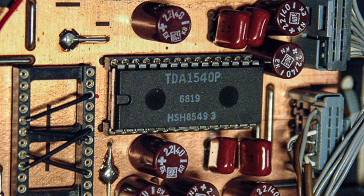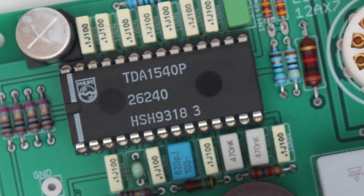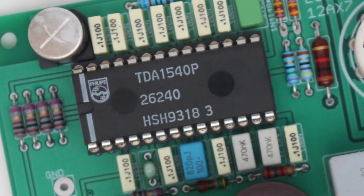This idea was great, but it was never really implemented properly by Philips. They just moved on. They never had an external oscillator feeding the DEM — they just installed a capacitor on the input, I think pins 16 and 17, and that's it. That passive, low-cost solution was part of all Philips TDA1540 and TDA1541 DACs and CD players back in the day, and it never changed. They moved on to noise shaping and lower-cost DACs — that's where the world went.